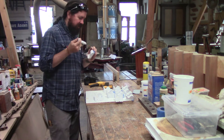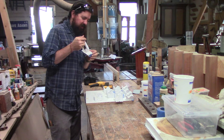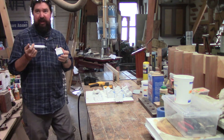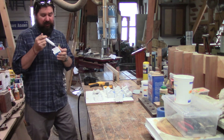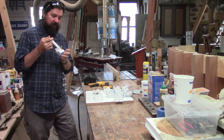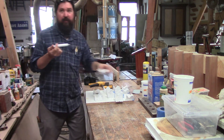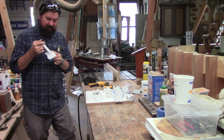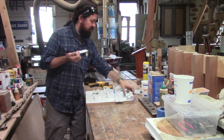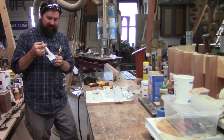With the Cornice Modillions, I'm filling the nail holes with just straight epoxy. It takes a few go-arounds before it starts to set at the top, but I figure while I have the opportunity, the epoxy will soak into the end grain and help shore this up. Being a couple hundred years old, you're really fighting with time. Rot isn't a linear progression, so anything I can do to try to plasticize the wood — that would be my take.